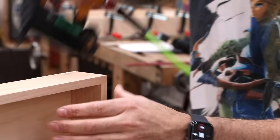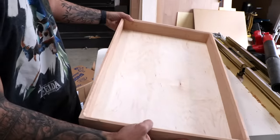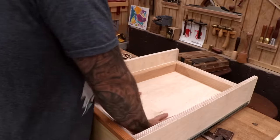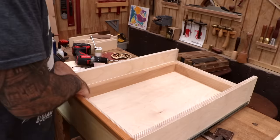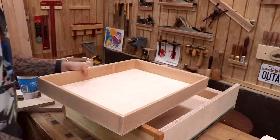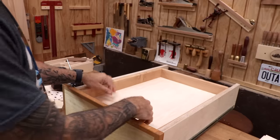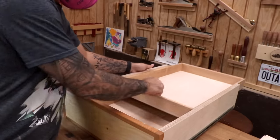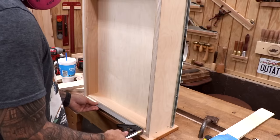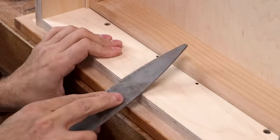Don't judge. The inside edges get a little chamfer that makes it a little bit easier on the fingers. Each tray is dropped in and sanded until the fit is what I need — snug for the bottom and sliding freely for the top. Keep in mind you don't really need a bottom tray. I made one because I thought it might make it easier to remove and modify the grid work we'll install later. By the time I realized I really didn't need it, it was already made, so whatever. In order to easily slide the top tray back, we're gonna need to carve a small relief for fingers.